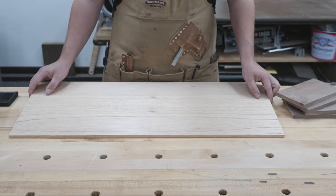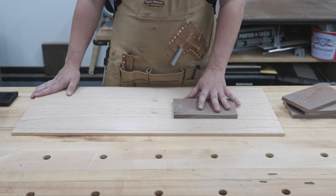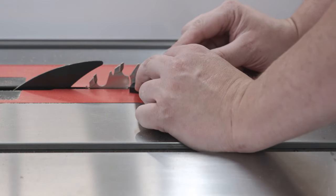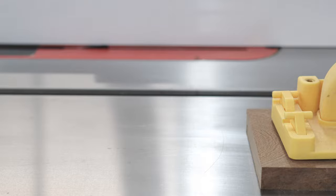I've prepared some Spanish cedar and planed that down to the appropriate thickness. I'm doing this now because I want to make sure that I get tight-fitting dados for the base. I'm looking at about a quarter-inch depth on the dados, so I'll use a setup block for that and get started on the tedious process of cutting dados. I'll normally move the fence just under an eighth inch between each pass, but once I get close to the final width, I'll barely move it and walk it until it fits nice and snugly.